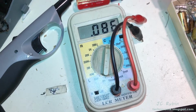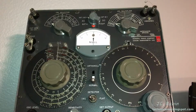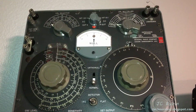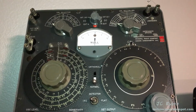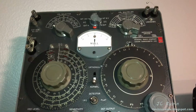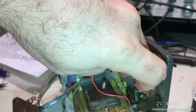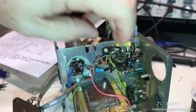My modern tester always had trouble accurately measuring picofarad, so I had to break out the Genrad. The Genrad, of course, is perfectly reliable, and it shows that this particular capacitor is about 510, 520 picofarads. That's good enough for me. I'll be able to install it now in the amplifier. I've added that ground wire here to the ground. I've cleaned up that ground, removed a lot of that material from the old test probe cable.